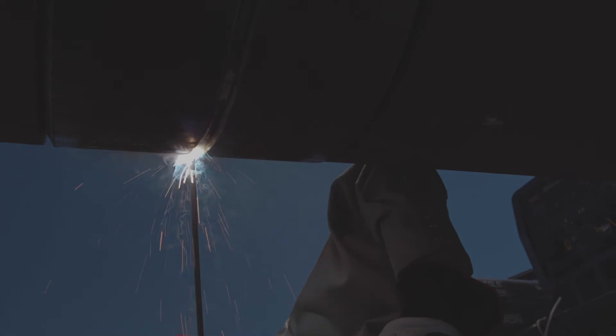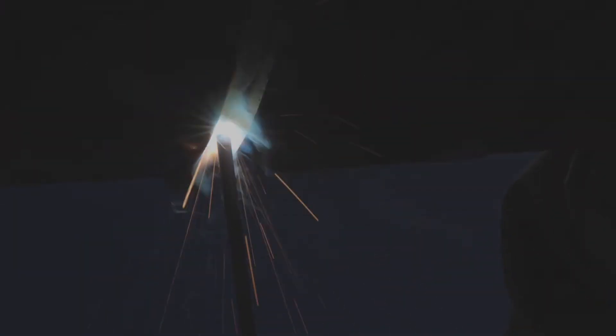I'm going to touch and go and we're off. Slight manipulation, keeping the rod angle consistent, letting the pipe adjust my rod angle for me. Going to a slight push, reading that puddle.